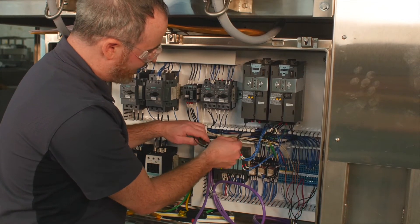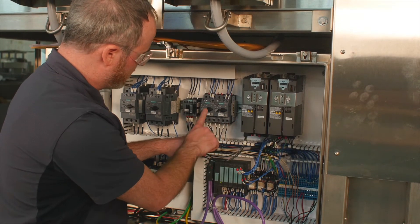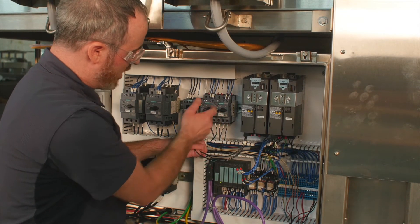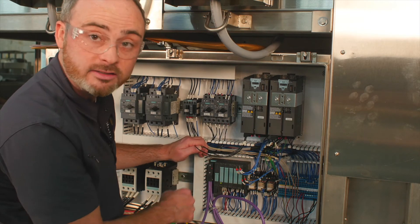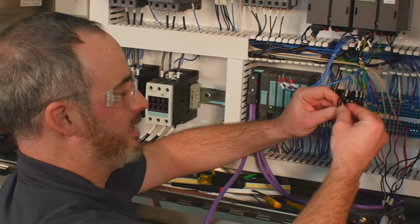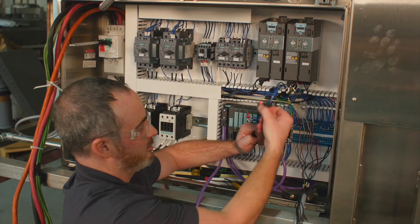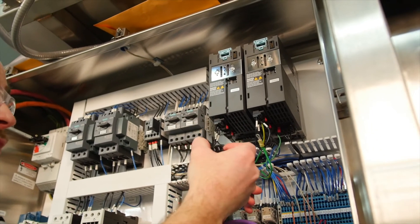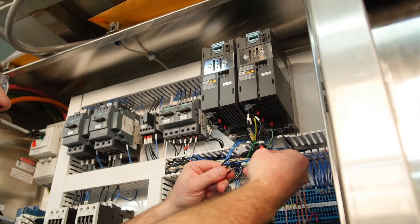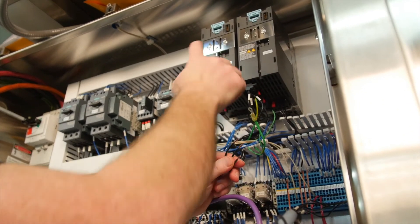Finishing up the line power to the G120 for the fryer conveyor from MSP201. When power is turned on, that'll feed power to the converter. Now with the motor leads from the fryer conveyor motor prepped, remove the connector by pressing the red button — a great feature of the G120 — and make up the motor leads on U, V, and W for the fryer conveyor power module.